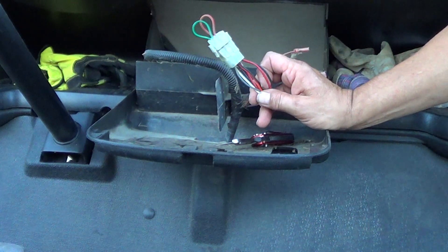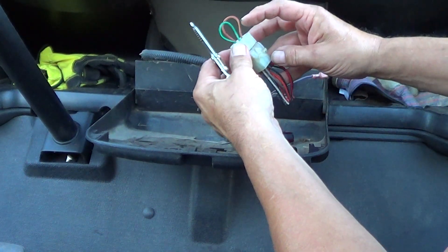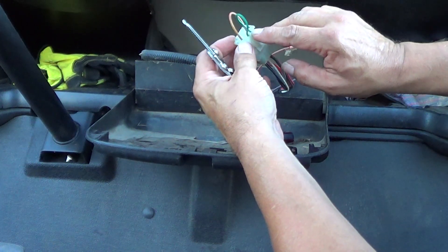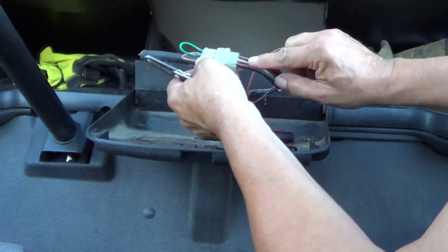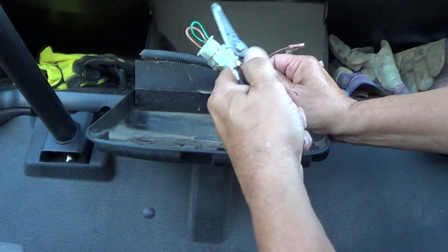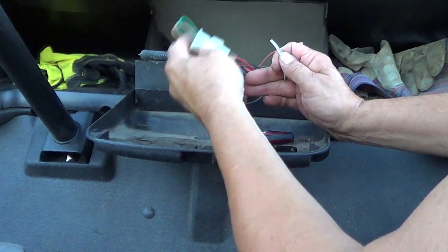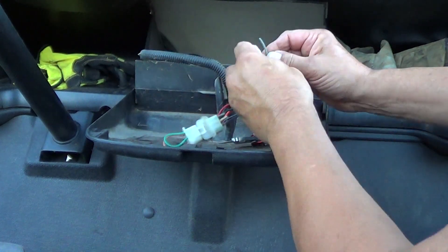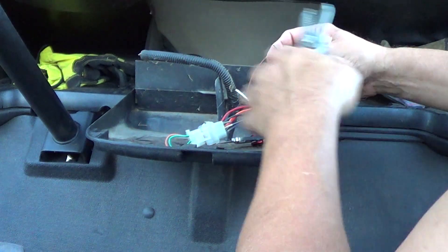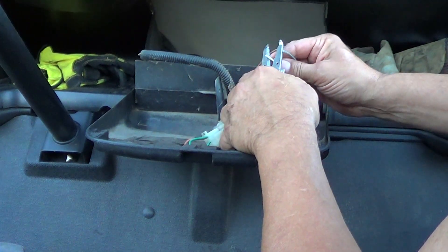What we can see at this point is which wires are involved. Since this plug goes straight through these two wires, this position and this position are jumpered right here. That comes straight through to this gray and this white right here. And what I'm going to do is I'm going to cut these wires right out, and then I am going to solder these wires together directly, so that there is no chance for a lost connection in this part of the circuit.